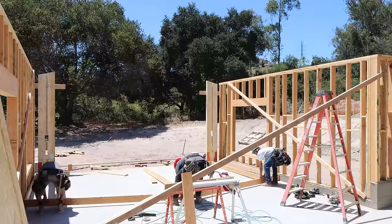It's a bit of a process, but you have to have plumb and line done before you can do any of your shear panel on the exterior. Because once you put that shear on, these walls aren't gonna move. So you wanna get them in place first with all your plumb and your line braces, and then go ahead and sheet.